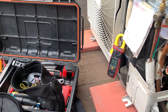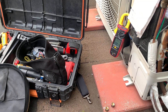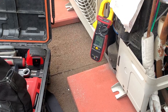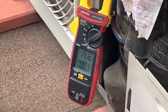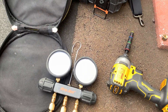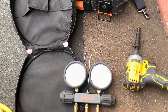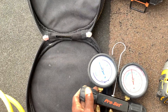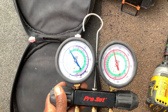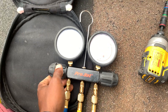I can hear the compressor ramping up even as we speak. My amperage seems to be leveling out around 14 amps. 55 degrees on the suction line. I'm going to squeeze a little bit more to get to 15 amps and then leave it there — I'm okay with 55 degrees suction line.